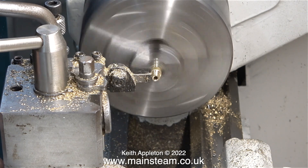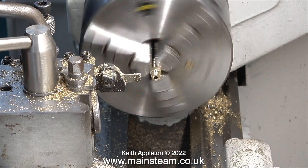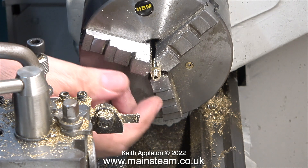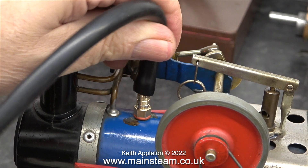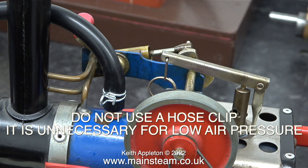After cutting the thread, the final part of the job is to use a very narrow parting tool to make a shallow groove where the hexagon finishes and the thread begins. The reason for this is so that I can fit a silicone O-ring. When working on these small toy steam engines you have to remember that the boiler bushes are soft soldered, and with a hexagon part where you can apply a spanner you could inadvertently over-tighten the part, and when you try to undo it maybe the bush would come out of the boiler - I've seen this happen a lot. Health and safety warning: never connect high pressure compressed air to a model boiler under any circumstances. If your compressor does not have a pressure gauge with the regulator valve on the air outlet, do not use it for this purpose. And to conclude the warnings: do not use a hose clip; it is unnecessary for low air pressure. I always use a spring clip on silicone rubber piping because I generally use higher pressure and I seldom work on small toys like this one - you have been warned.